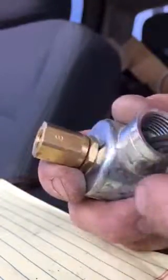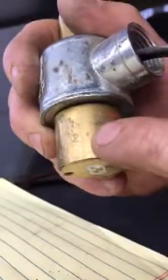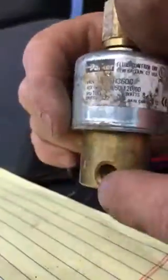First we have number 3. This is always fresh water on an end gun. We have number 2. It's always to your valve on your end gun. And number 1 is always going to be our exhaust port. Okay, so what we're going to do is take the freshwater end off while it's still attached to the end gun box.